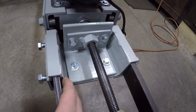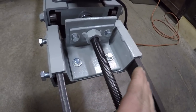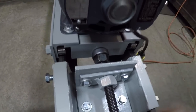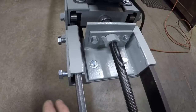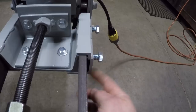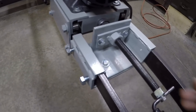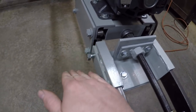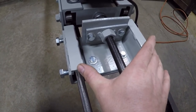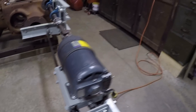One last thing to point out: I have this piece of six-inch channel here that all this attaches to. That is acting as a spacer for my rails to keep them out against each side of the cart that the motor rides on. The way that works is I boxed in each side of that channel with these pieces of angle iron and added four jam bolts — two on each side — so that when those bolts are tight, it not only keeps my feed plate from kicking up and down but also keeps these tracks tight in against the edges of this six-inch channel, keeping my spacing exactly where I need it. So now all that's left to do is try it out.